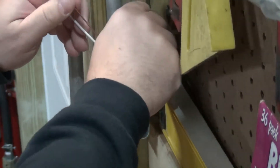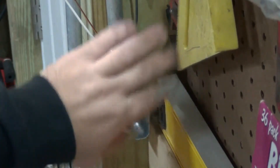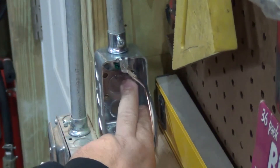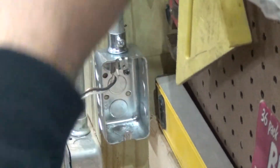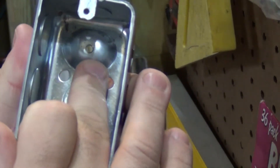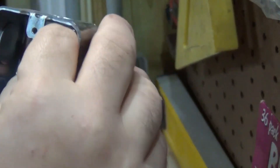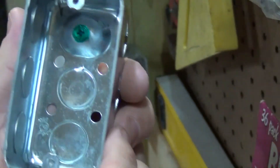Pull these wires out of the way. Right here you can see I have a green ground screw. See how it goes into this box I have right here. Ground screws are separate — I have one right here. Pull one out. You want to make sure they're all grounded on the box. Where you put the ground screw, just insert it like so and screw it in. Now it's started — then you can wrap your ground wire around there, which I'll show you.